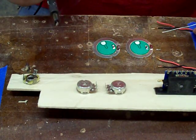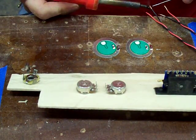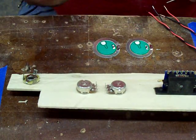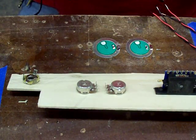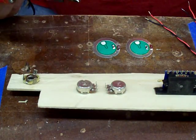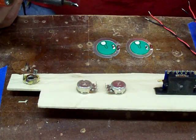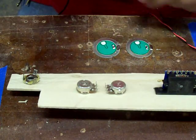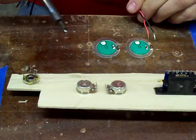Next I like to go ahead and put a little solder on my wires. That ceramic on the Piezo is thin - I'd say it's thinner than paper. So if you put the heat on it too long, you're going to burn through it and waste Piezos. By pre-tinning the Piezo, giving it a few seconds to cool, and pre-tinning the wires, then when it's time to put the wire on there, you're not on it with the heat but just a second.